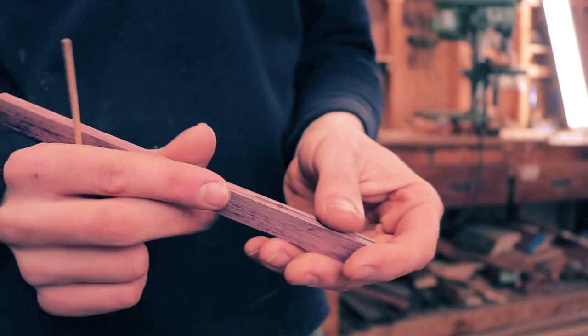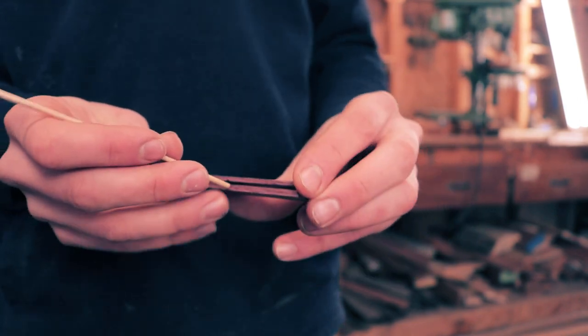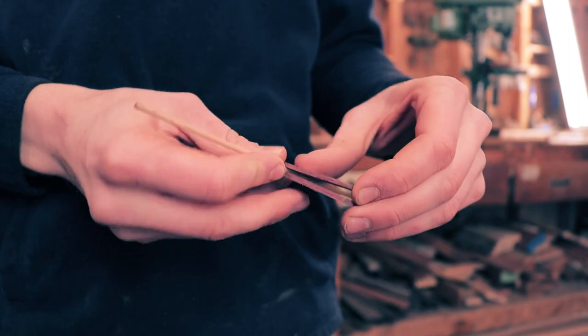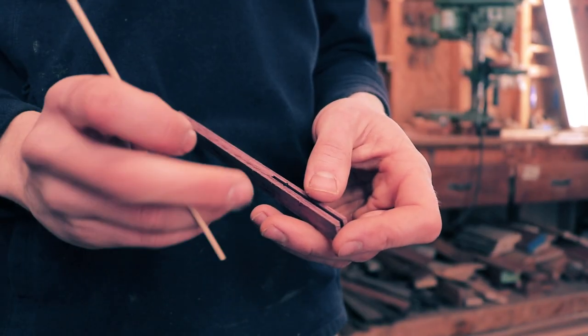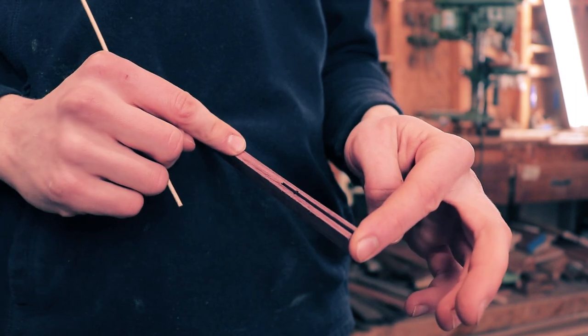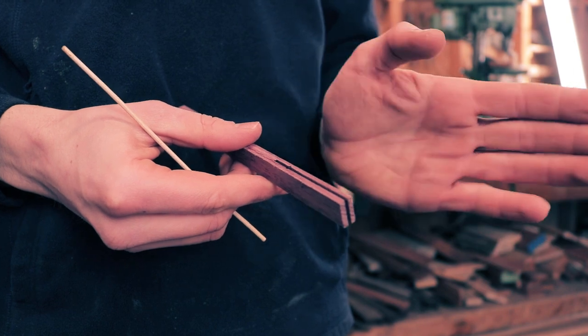This is not so good. I cut it and the problem is, first off, this doesn't make it flex out. I drilled my hole too big. I could just make a bigger pin, but that'd be more work. What I'm actually going to do is not use a pin and just use a flat piece of wood. That means I need to make my groove here quite a bit deeper, and then I'll put the piece of wood back here and it will spring like it's supposed to.